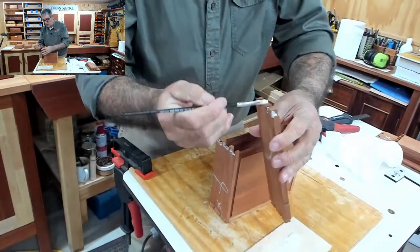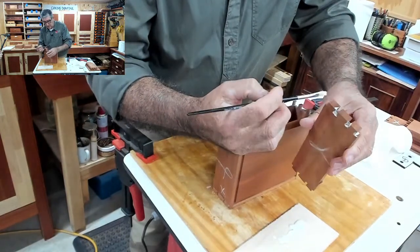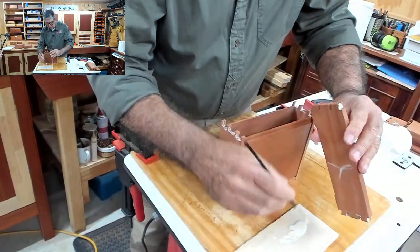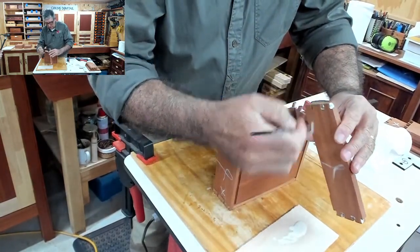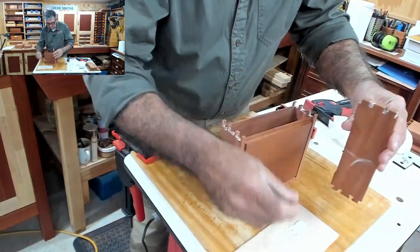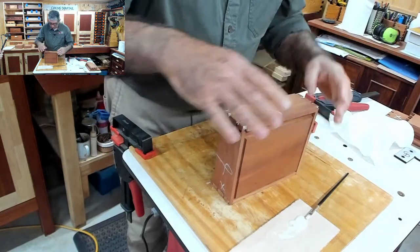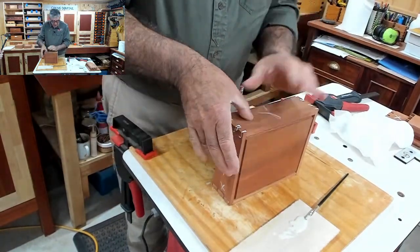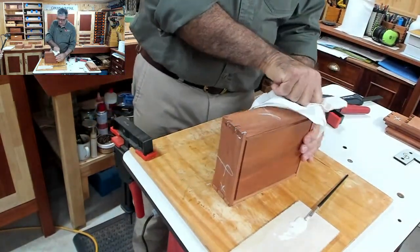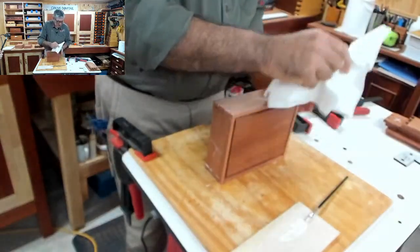Inside, you can see, now I'm working on the thicker piece of timber, this is the back edge. You can see it's much thicker. This is the 10mm section that's going to have the hinge in it when I put the hinges on the box. Just make sure you put this on the right way. I've seen people put them on back to front. That doesn't help. Because when you get it on there and you can't fit it together and you tend to squeeze it up, doesn't really work very well.